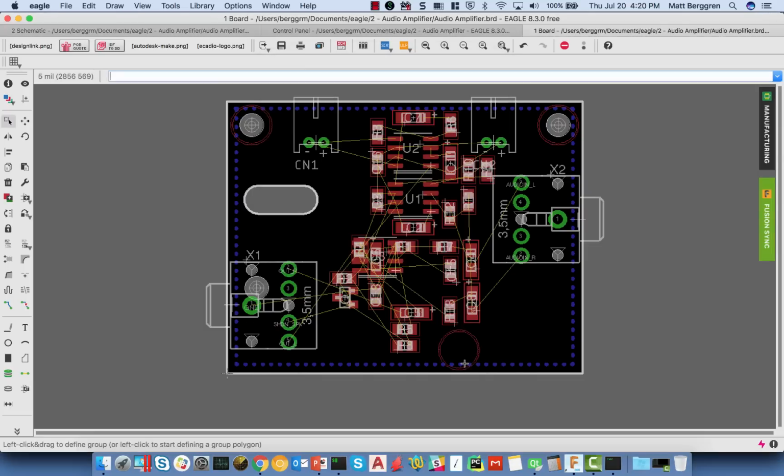The good thing is that all of that stuff, all that hard work that we did with walk around routing and those sorts of things, they observe slots in the board now. So they'll actually follow the slot in the board, ensure the fact that you don't have an area where you've got a track running through a section of board area in which the board shape has been cut away, or the board has actually been cut away.